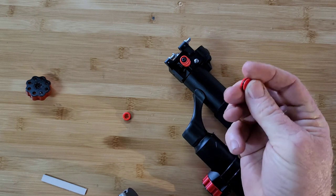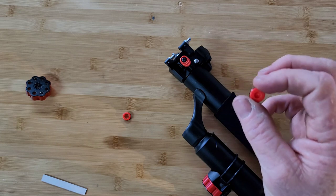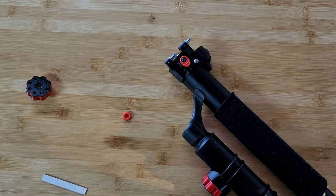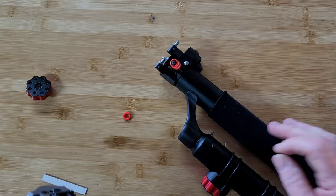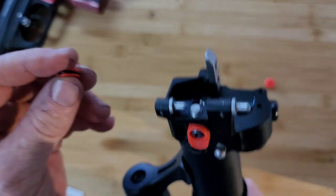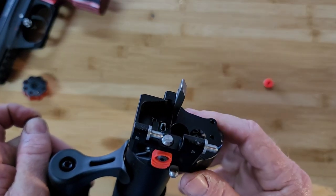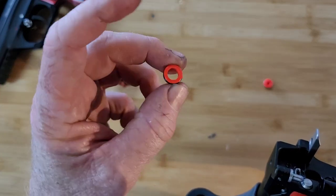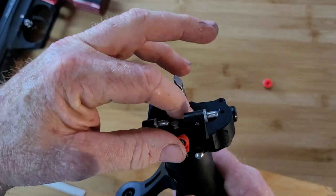This was not designed to be used at full power on a regulator with this lock and this much air restriction coming out of the transfer port. The reason this is included is that you can drill your own out - and as long as you drill it out, you can go from probably 12 foot-pounds all the way up to full power without having to mess with the regulator much. The pucks must always be in place - without the puck in place, this will not seal and it will not cycle the magazine, because the back of this is sealed by the little puck.